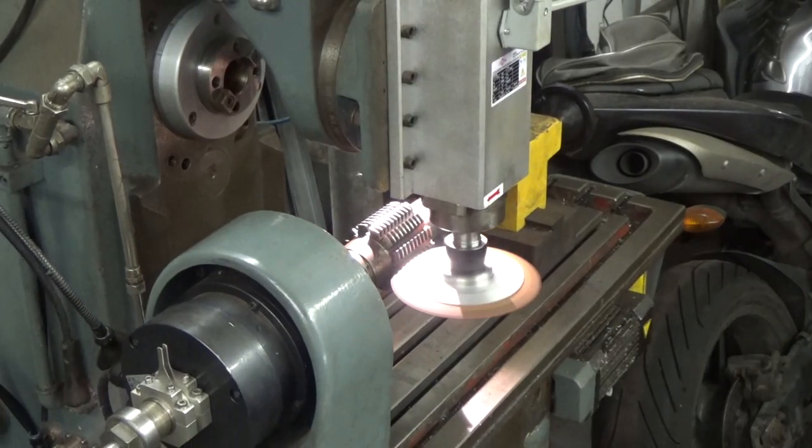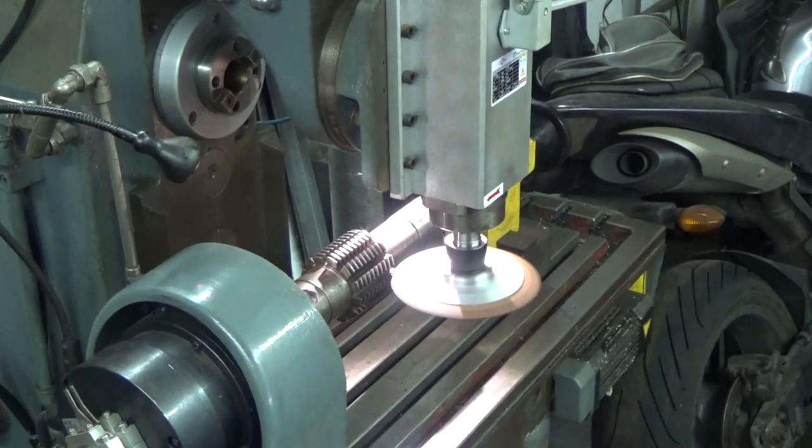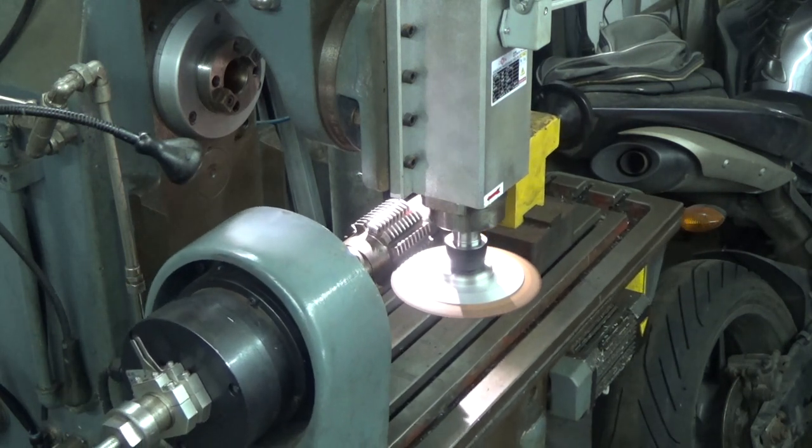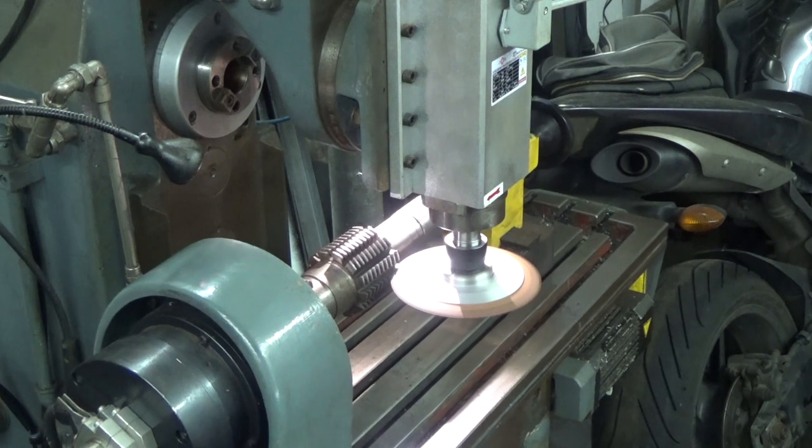The reason for the high speed head is that whilst I managed to find the right 14.5 pressure angle 14dp hob on eBay, when it arrived it wasn't very sharp, so the first job was to sharpen it.